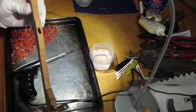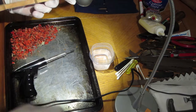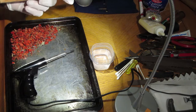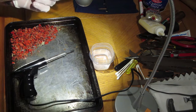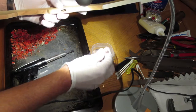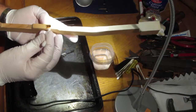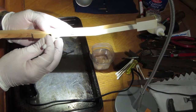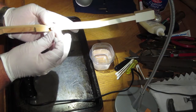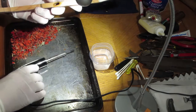Now the balance rail is a little bit harder, especially on this old piano. As I say, this felt is probably 100 years old, or 96 years, or whatever it works out to, from 1920 until now. So it takes a little bit more to get it out. So what you're going to want to do is put some water on it. This particular one only has one felt in it, so that makes it a little easier. The other felt is either disintegrated or just worn away. So we get it nice and wet.